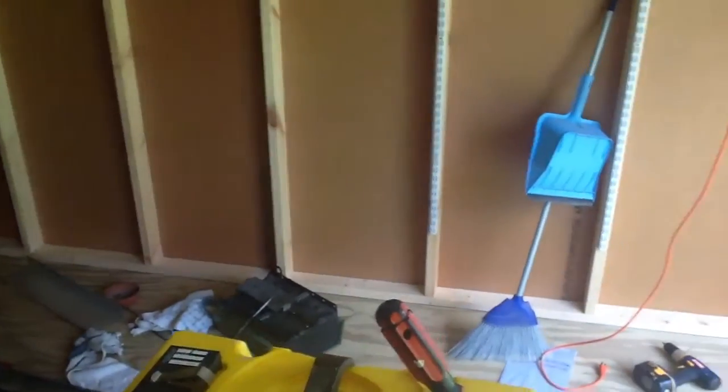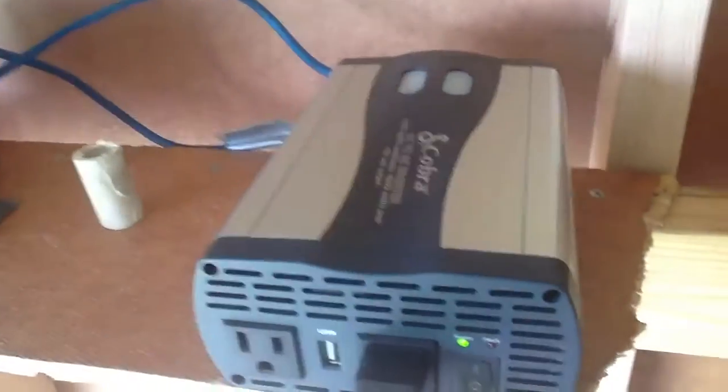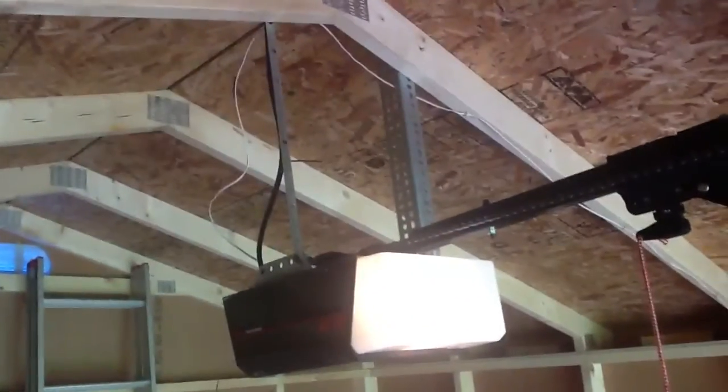Anyway, that's what's been going on. This is a 12 by 16 shed with an 8 by 6'6" door. The next opener I want to put in is a screw drive — bear in mind this is only an 800-watt inverter, so when I put that up there will not be a light bulb in it and I have to wire sensors. The angle iron: I ran out of some of this stuff so I had to use the piece they give you, but it's sturdy — it's not going anywhere, and it's a lot more sturdy than the one in the garage.